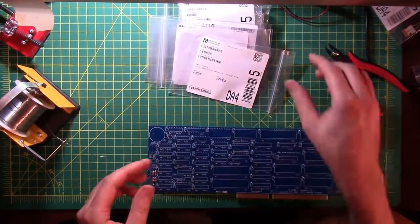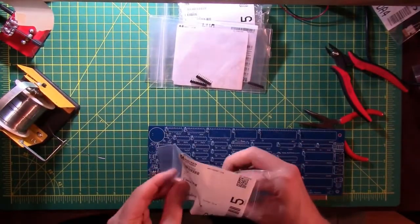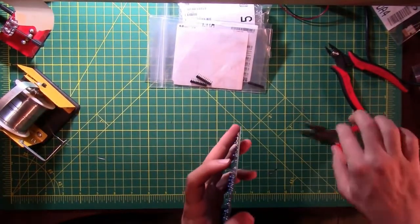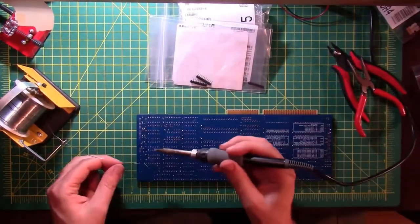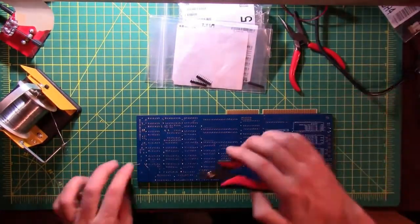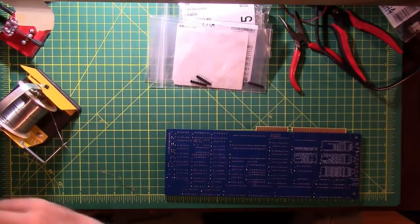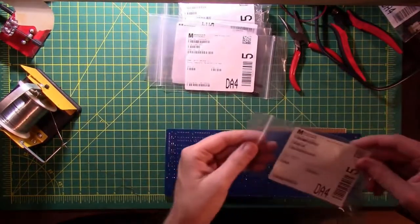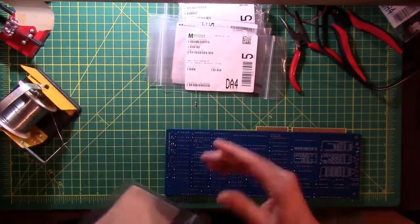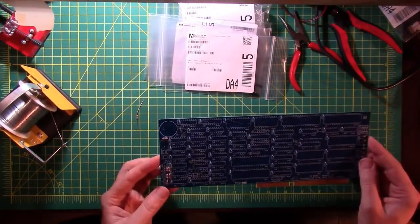He's just spacing these really tight, so you can't just bend them over by hand. You gotta bend them over really, really close to the end of the resistor. And I need R6, which is a 1 kilo-ohm resistor. Now I need a 33 kilo-ohm resistor. I think that's back in the pack in the other direction. Yep. Oh, threw that one right off the table. R7. There it is.